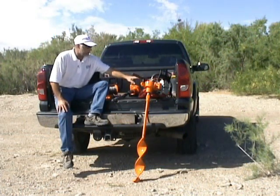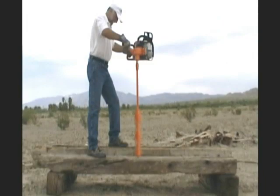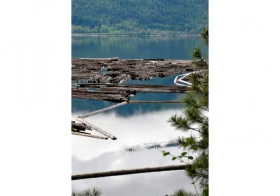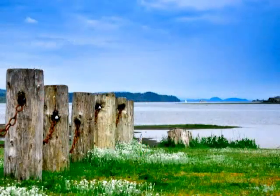I've got one hooked up to my Solo chainsaw and this is sitting on a boomstick auger. A boomstick auger is used to drill the large holes you see in logs where they run chains through and tie them all together to tow the logs behind tugboats. Another great use for a boomstick auger is to drill holes in railway ties where they run chains through for funky fences.